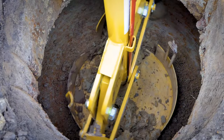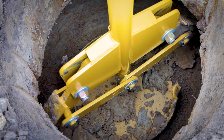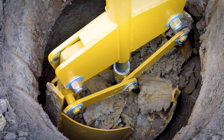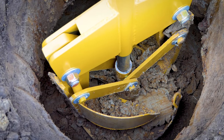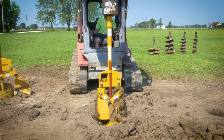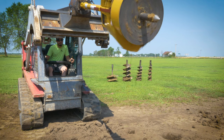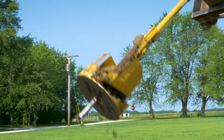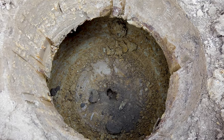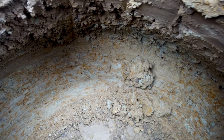The blades guide the soil inwards as they cut the soil away from the edges, and when we withdraw the auger, it'll just collect it all into the interior and pull it right out. Take it slow — usually just a few turns is enough to gather enough soil inside the auger. Then, just as you would with the standard auger, tap and rotate the belling auger to remove the collected soil, and what you're left with is a clean hole free of soil. That took all of maybe five to ten minutes to cut.